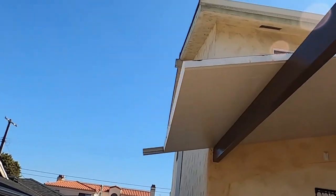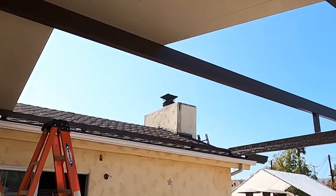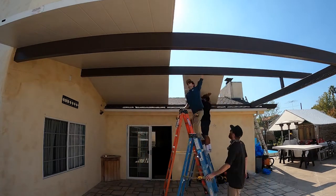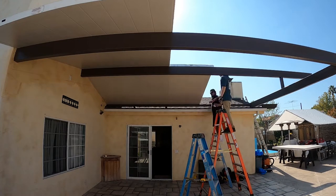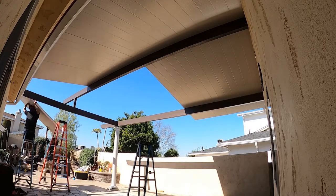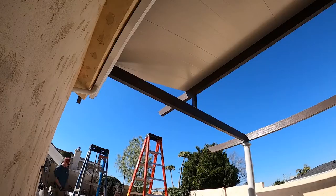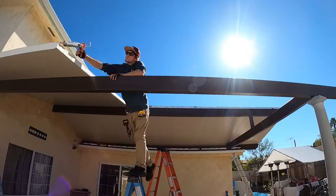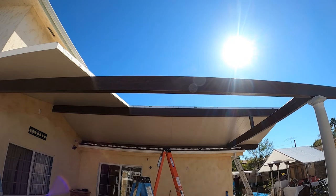That's the planking feature you see on the insulated panels — it gives it a more homey feel underneath. This is us locking the panels together as we go. You can see in the middle of some of the panels there's a metal channel, or electrical chase — we call it a fan beam, but technically it's an electrical chase to be used for lights, fans, whatever you want to put there. There I'm sealing the panels before we add the next one.